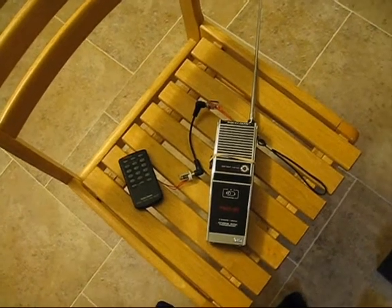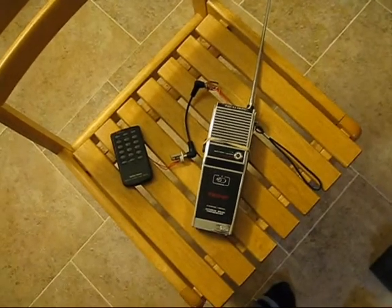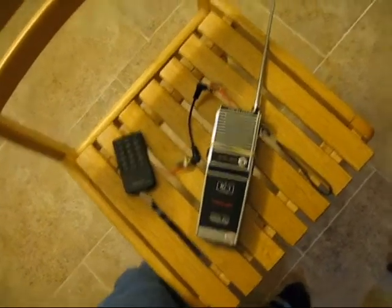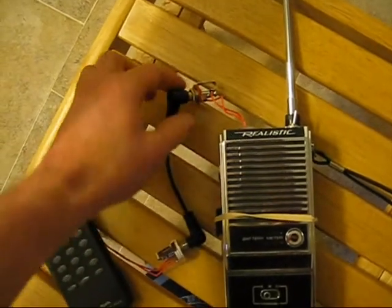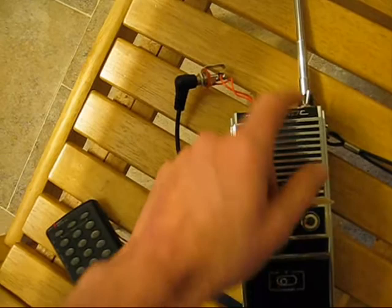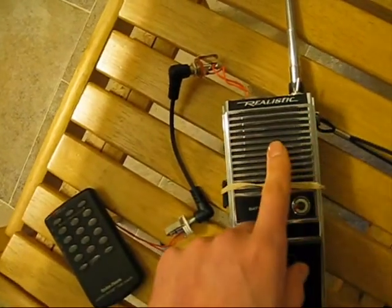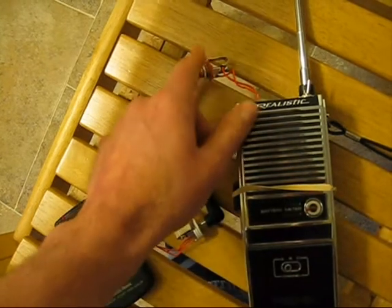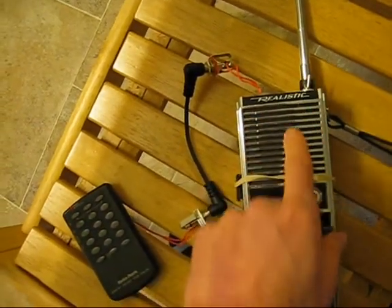What I have here is a toy that I call Robot Radio. What I did was I bought a pair of walkie talkies off of eBay, super cheap. From both of them I soldered on a quarter inch jack to the speaker slash microphone. I also set up a switch so that I could turn on or off that speaker microphone. The leads here are always hot, but the speaker can be turned off if need be.